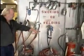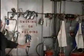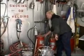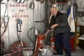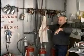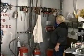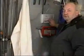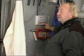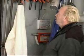As you can see, as you come down over the side here, you see where the fire extinguisher system goes into the booth. These two systems right here, if there is a fire in the booth, will dump within 7 seconds. And it's a powder which will smother out the fire. In here we have the ProChem. Here's our manometer, which shows us the time where we need, when it hits this red arrow into about 20, 25, that's time for the filters to change.